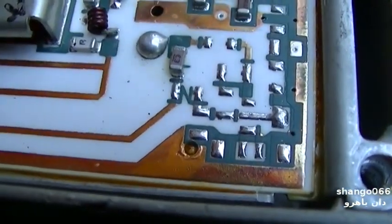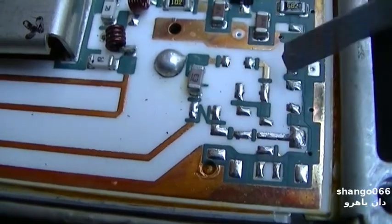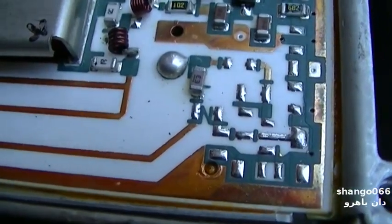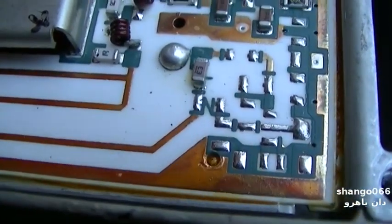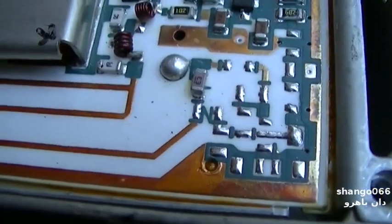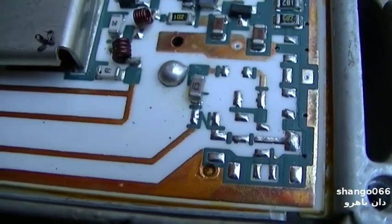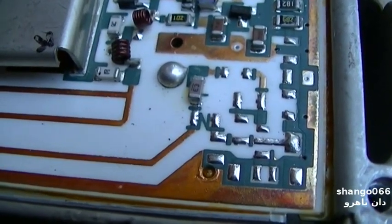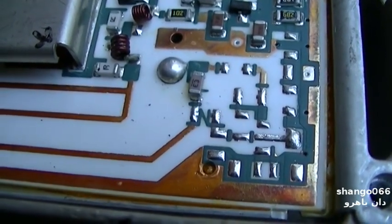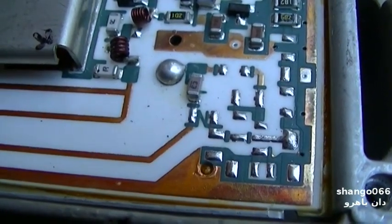What Motorola does when they don't populate this section is put a capacitor here to run the RF coming in directly without the preamp. One of the major drawbacks is that this board is a ceramic material that acts like a giant heat sink — and that's an understatement. I've tried to solder to this stuff before with very limited luck, but we're going to give it a try.